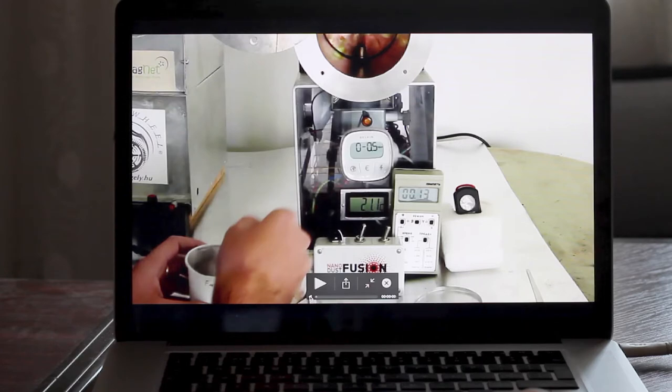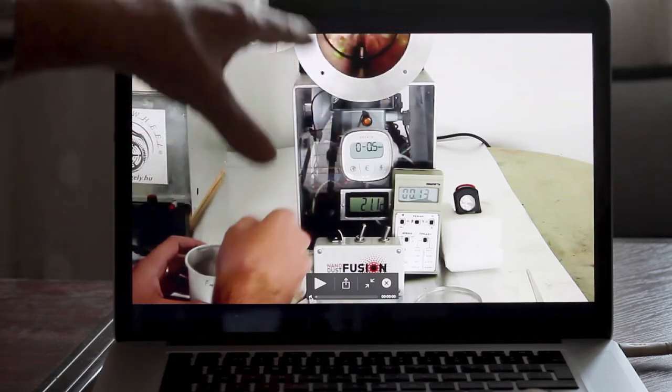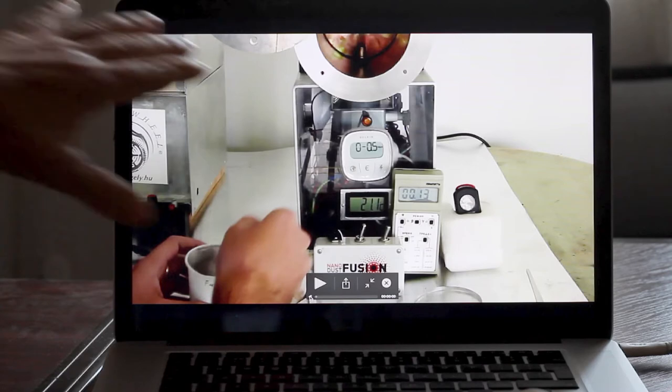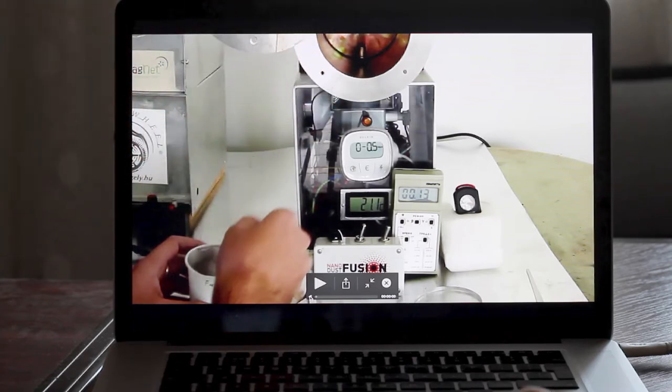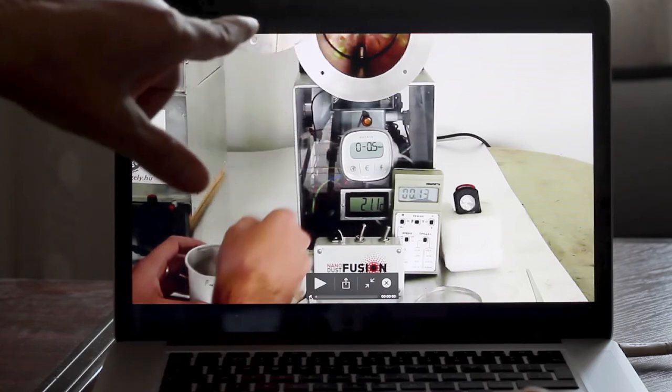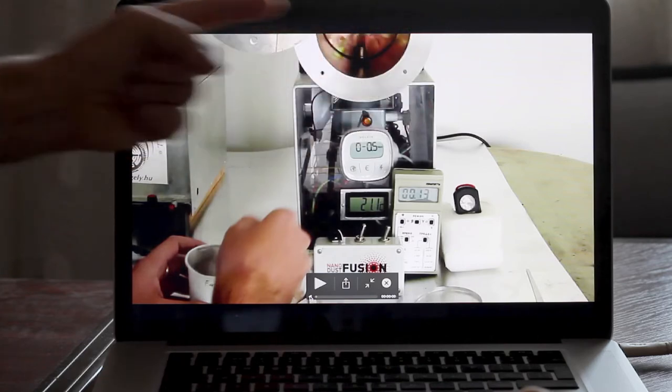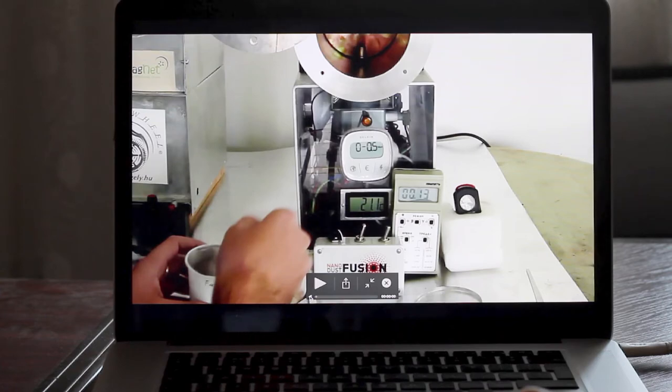If we want to use, let's say, cylinders, long quartz tubes, which is the cheapest, then we have to use another type of microwave resonator, which is called the transverse magnetic, TM. This is quite known in electrical engineering. It has a different design, different sizes, lengths, because the resonances are pronounced along the axis of these electromagnetic radiators. But here the transverse electric fields are just across these cylinders, so quite different.